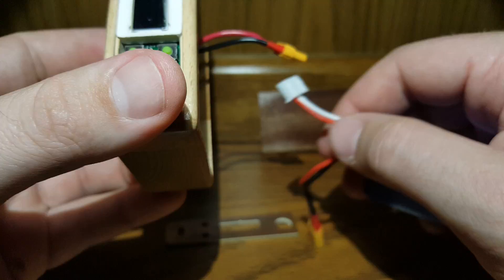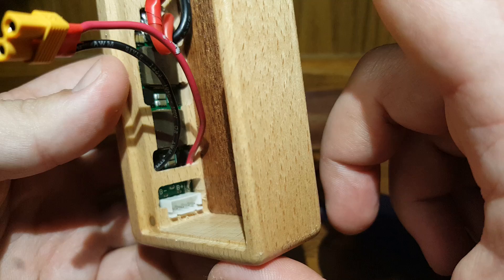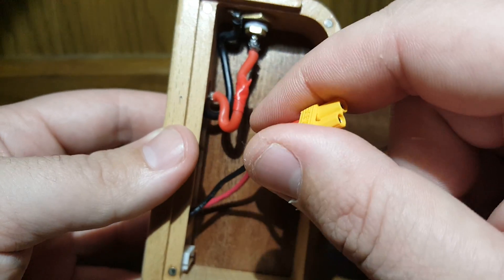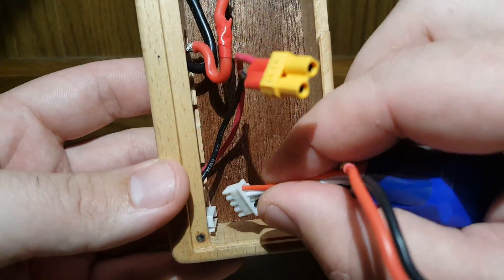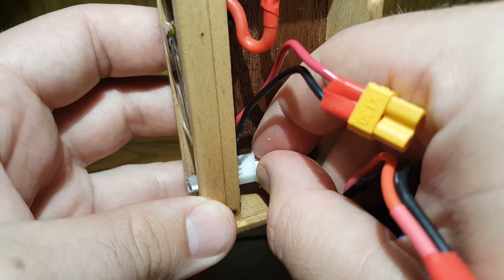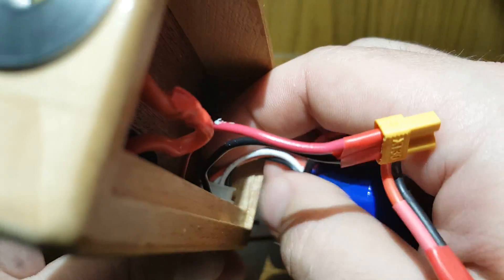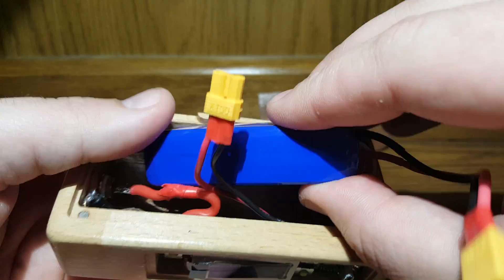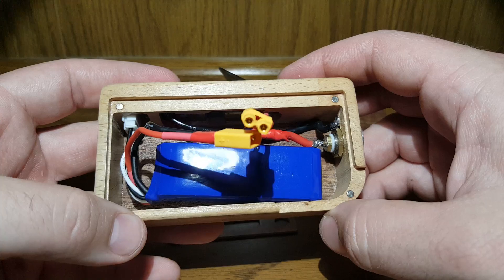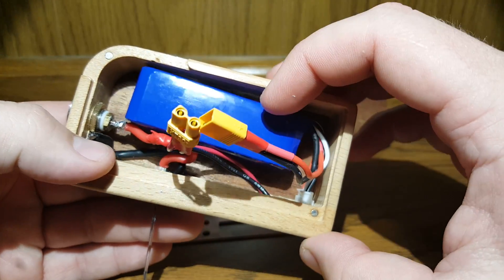So what I had to do first thing was desolder all these tabs. I took this back out, desoldered the tabs, flipped the connector around, and cut out the battery tray so I was left with just this. Now it's really simple - actually super simple - to connect this all up. I've already had this hooked up, but I just wanted to show. We're going to connect the tap in here - there, that snapped in - and just roll this around in here. This battery has tons of space and plenty of room.